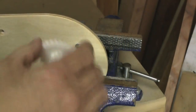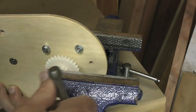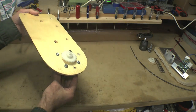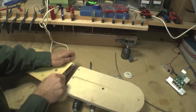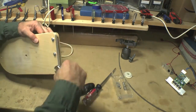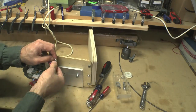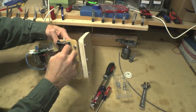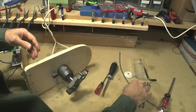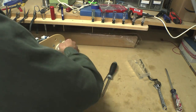The first task was mounting a stepper motor onto the bottom board — basically drilling some holes, lining things up, and pressing a gear onto the stepper motor. It's just what's called an interference fit; basically friction holds it on. The whole thing comes together easily enough. Of course, if you have to build it for the first time and drill all the holes and figure out the design it takes longer, but here I'm just reassembling it. The tricky part is putting in that threaded rod, because you have to turn the gear that sits underneath the one on top of the stepper motor.